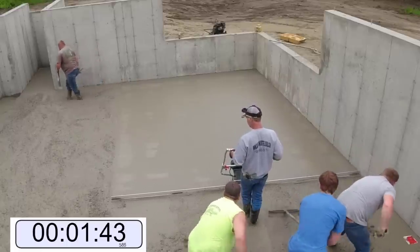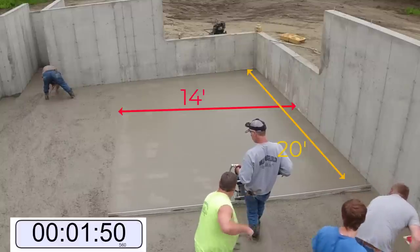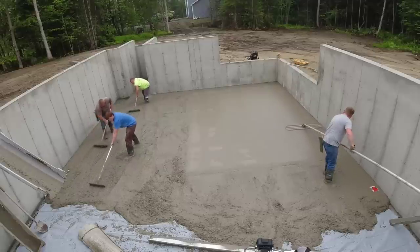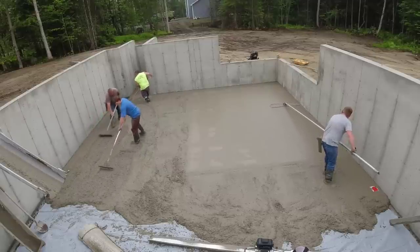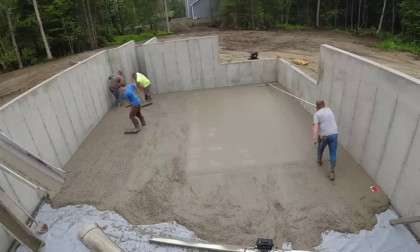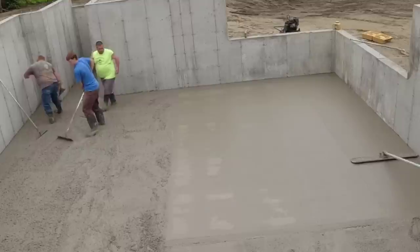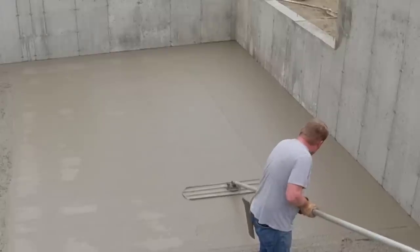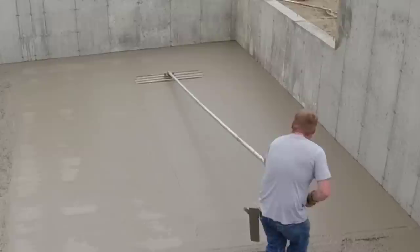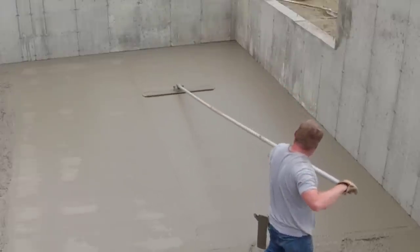I'm getting close to the 20-foot mark now, and the timer stops when I stop. So that's a 20 by 14 section — 280 square feet in a minute and 52 seconds. That's not too bad. That's basically the end of the first truck. You can see when Darren's running the bull float over that, just how nice and flat it looks — how smooth it is. He basically just has to go down and back once, and he's done bull floating because of the pace the vibrating screed works as it screeds. It makes bull floating super simple.